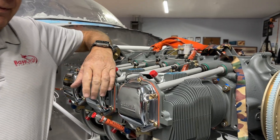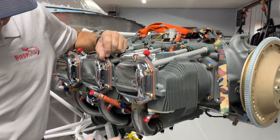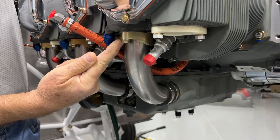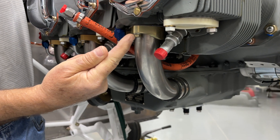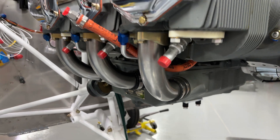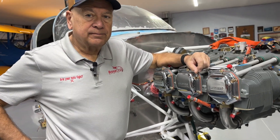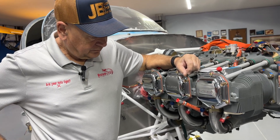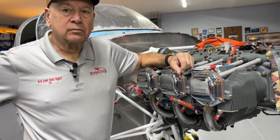We sourced some stainless steel intake pipes and installed those along with the Superior 73346 intake flanges. The intake flanges that attach to the cylinder are a constant issue — the pipe wears into that flange and then it becomes loose at the cylinder where the intake gasket attaches. The billet flanges seem to be way less susceptible to that wear and are holding up much better.